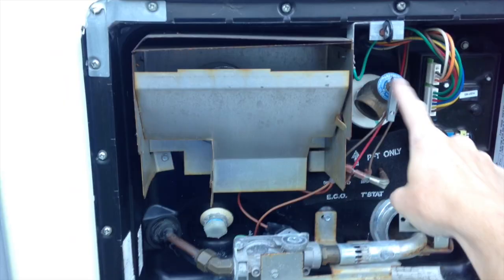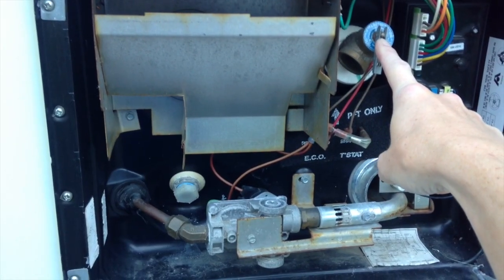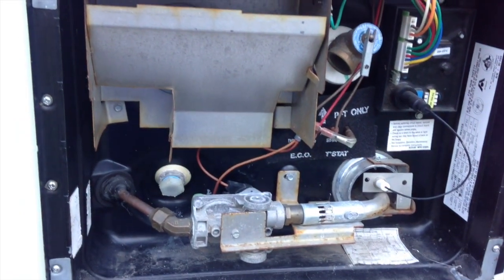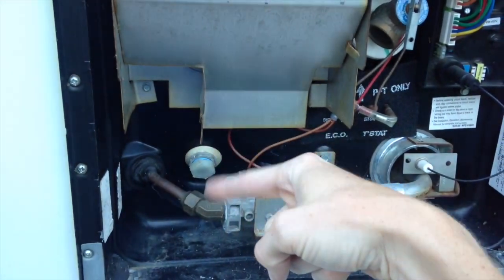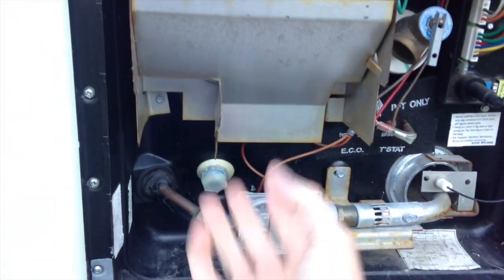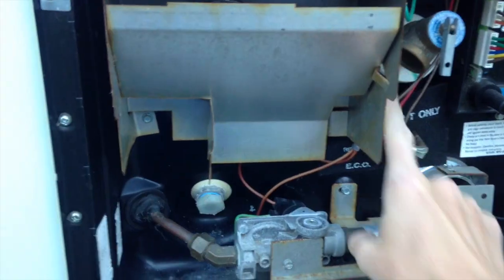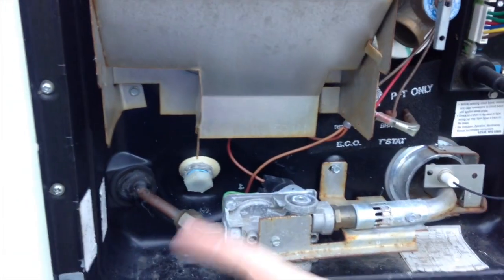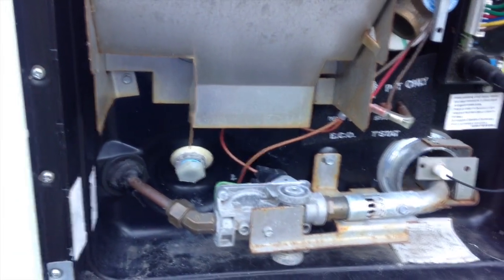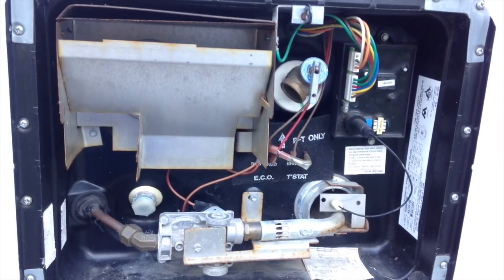And then the other important component for your draining process is going to be this guy right here. This is a temperature and pressure relief valve. And once you have shut off your valves on the inside of the water heater for your bypass, there will be no way for any air to get into your water heater tank to allow this to drain properly. So it's just going to kind of glug out and glug out and glug out unless you open this relief valve. That way air can go straight up in there, and then it will cause better airflow so that you can get your water to come out of here on a steady stream. And that'll give you better draining and a more complete drain on your water heater tank.